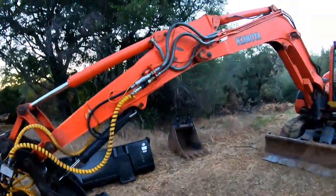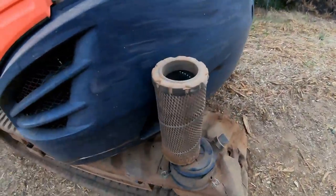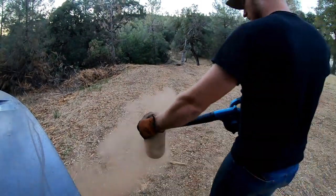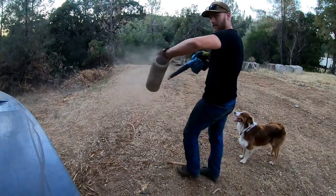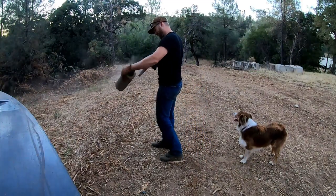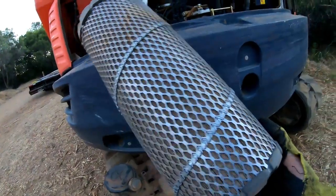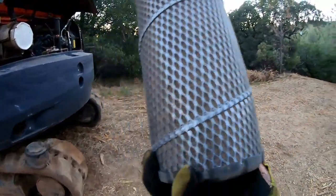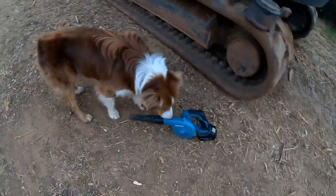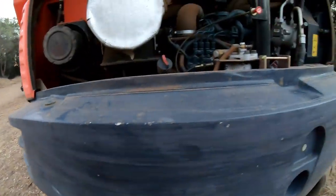Much like a pre-trip inspection on your truck, same thing for a machine. Just greased her, checked the oil, and all we got to do is clean the air cleaner. We're not going to pull out a hose off the truck — we got something good right here. Some people don't like to blow their air cleaners out and just replace it, but the excavator doesn't really get into the dustiest situations, not like a mulcher does. So I'll use that — it's not really high pressure, more volume. Direct it out that little nozzle and it does a pretty good job for stuff just like this.